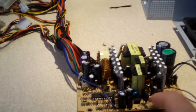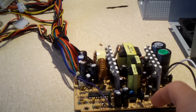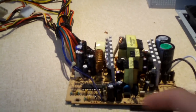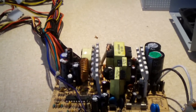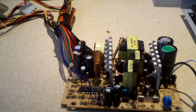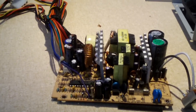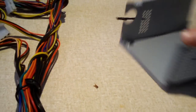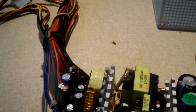It's almost like they attempted to make a half decent power supply but they just failed. What's funny is in Newegg's description, it claims that it has an EMI filter. Well, truth is, they sort of attempted one with two Y capacitors, but no X capacitor, no coil. You see no X cap, no coil, and no X cap on the AC plug. All I can say is epic fail there.